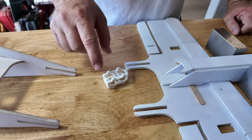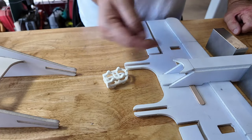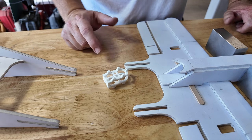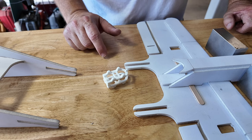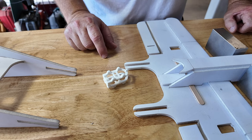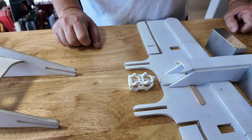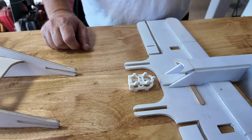I don't put a lot of hot glue on the inside underneath of this because this is a pusher. It's always going to be pushing the airframe forward, so it doesn't require much. It's not going to pull itself out. It's not like on a tractor airplane where the motor is always pulling away from the foam board that is the fuselage. In this case, it's always pushing into it. So you're not going to have any problem with it adhering or not. So let's go ahead and just finish the airframe.